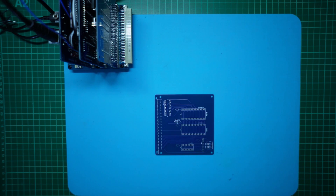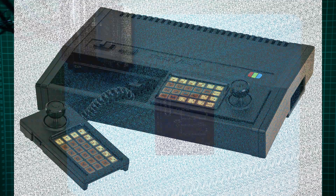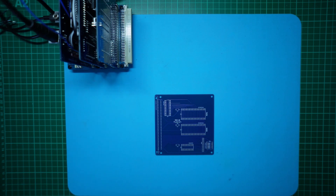First some background. Some time ago I decided I wanted a cartridge-style ROM card to plug into my MECB backplane. This thought originally came about while considering that it might eventually mimic the Creatovision TV console of the early 1980s. The Creatovision was a 6502-based system which also used the TMS VDP video chip and a Motorola PIA. So once I have a 6502 CPU card to team up with my existing TMS9918A video card and Motorola IO card, I'll be ready to explore this possibility.